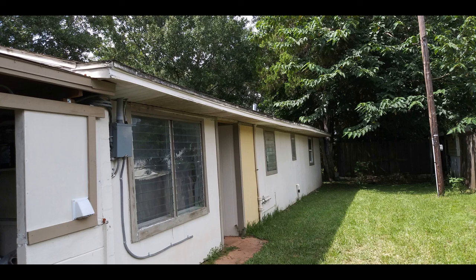Since I was asked to use the existing soffit, I had to be careful to maintain the same spacing as before. Once I connected 2 pieces of soffit, I pulled them snug to ensure that they were fully locked in on the side where they were connected. It would be a pain if you got to the end of the run and found yourself a few inches short. You'd have to go back and pull each joint apart, wrestling with a bunch of plastic that really doesn't want to move.